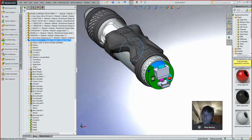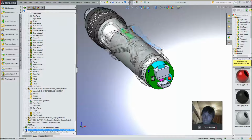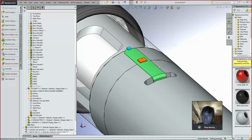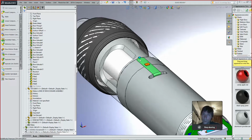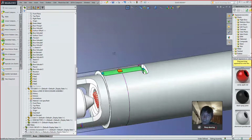Right, so there's the flex circuit underneath the chassis. Here's the rubber overmold. These molds are done. The chassis right here is going to have a little window that allows the flex circuit to come up, and the button is right there, and then the LED is right there, and then there's our tactile micro switch. So that little tongue of circuit can sit outside the chassis under the overmold, where the tactile micro switch can get activated to fire the circuit off.